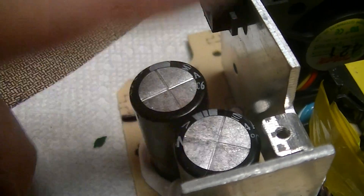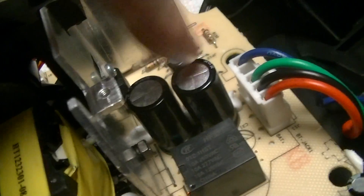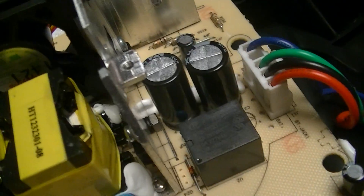There are Y caps and input caps — those are Samsung. The output ripple suppression capacitors are also Samsung. The other caps are Chong brand, so they're not the greatest for long-term reliability; those will probably get replaced.